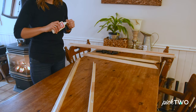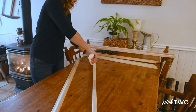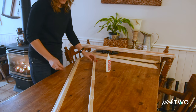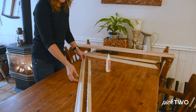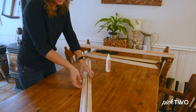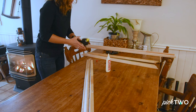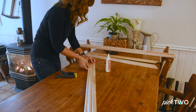What you want to do is take your quick-dry glue and run a very light bead all the way down one edge of your corner piece — just a little bit, you don't need that much. Then take the fat end of the ply cap and attach it to the side. Now because this piece isn't quite one inch, we have to bring it up to match the same height, and that's where our clamps are very important.